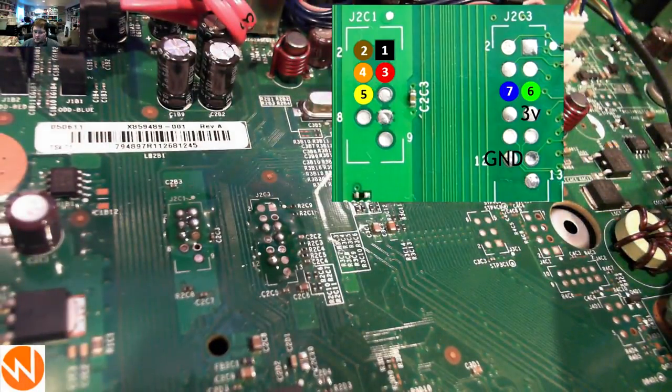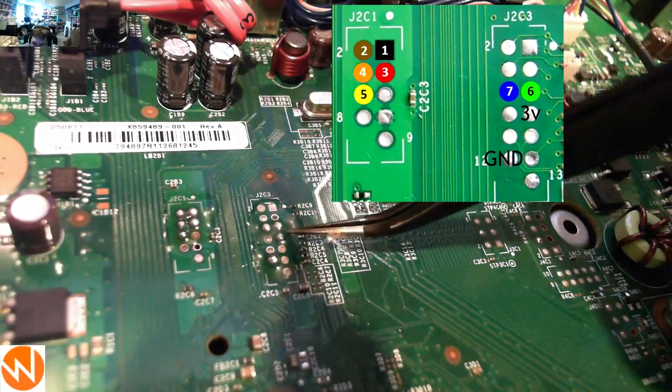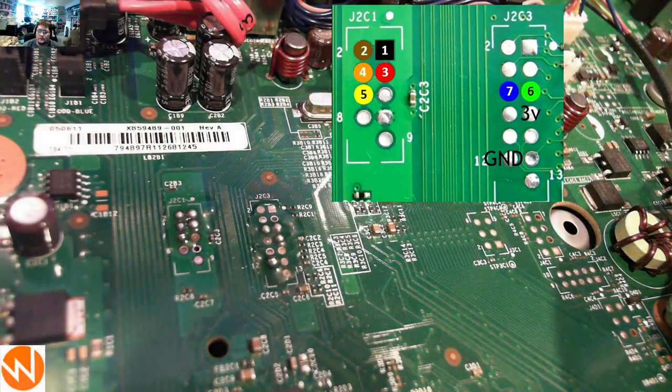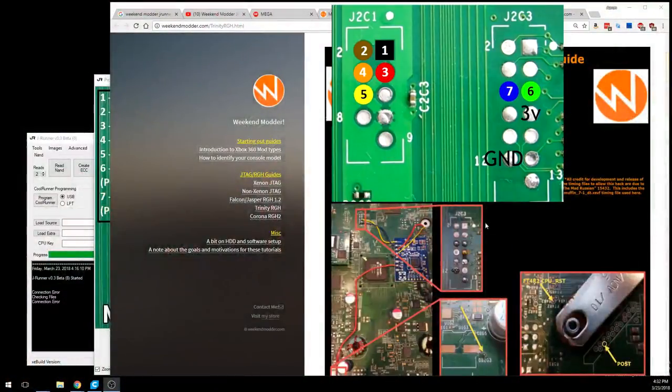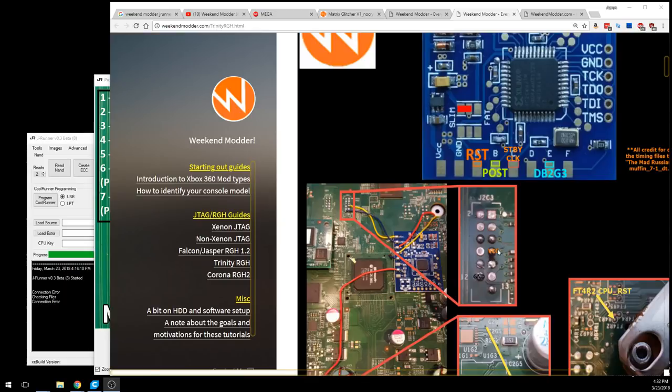Now that those are pre-installed, I want to point out that I also pre-tinned two additional pads — these two pads are going to be our power and ground. Looking at the reference install image zoomed in, you can see VCC for power and ground. I went ahead and pre-tinned those spots at the same time to be ready for VCC and ground on the chip.